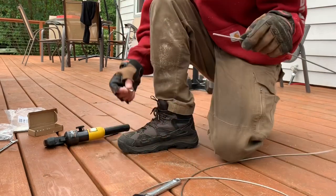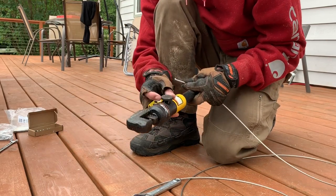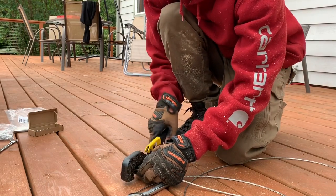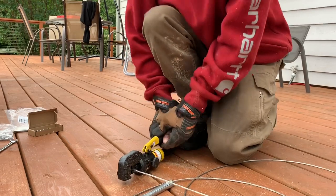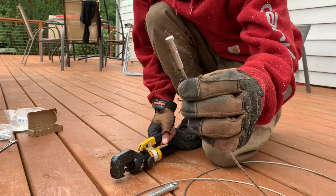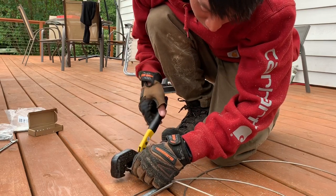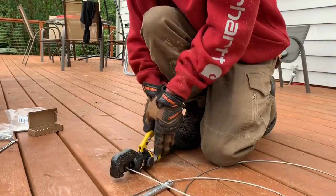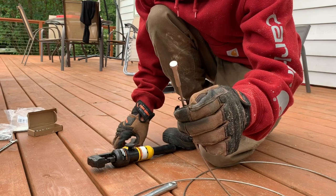Alright, so hopefully I'm in this shot here. You just take the butt end piece, put the end of your cable over it with the swager or the hydraulic crimping tool, turn it to on, put that guy inside of there, and just crank it. There we go — make sure it cables all the way through. Turn the lever and the hydraulic releases. That's what you get there. I like to crimp it twice in a different direction just to make sure it has a good hold. There you go — that's how you do the end of it.